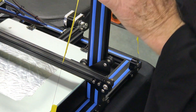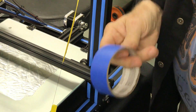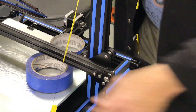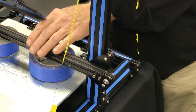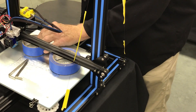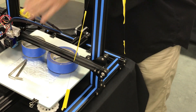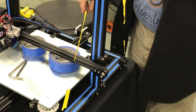One thing I forgot to mention — this is handy to have. I'm using two rolls of tape, but you can use anything equal in size, something soft enough that won't damage this part. I'm going to put them across here so when we true this up the block will be even across here. You can see this one's tight and there's space underneath here, so this thing is in really bad need of truing. Make sure you don't have it up on a bracket underneath — take a peek — okay, we're good.